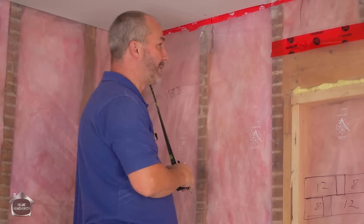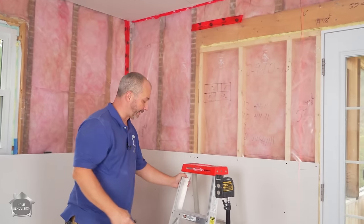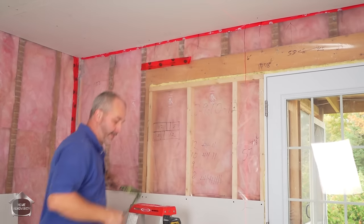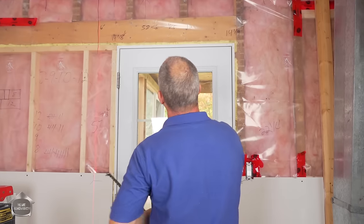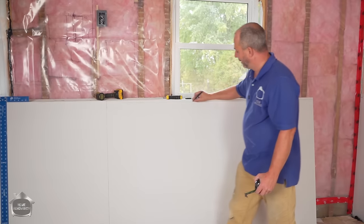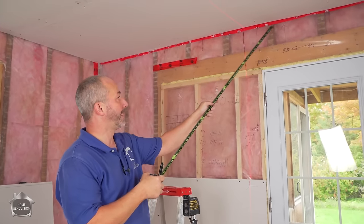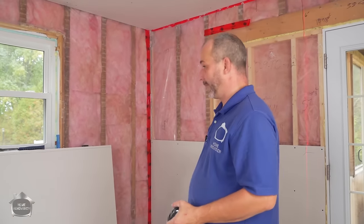This is just over four feet — don't need a measurement. That one's exactly four feet and I'm okay if there's a little gap at the top of the sheet — we can fix that later. Just under four feet over here, it's 47 and a half inches. The ceiling definitely drops here a little bit, so I'm taking a half inch off the top over here because this whole side drops. Now that I've got a level edge — you can see how the tape just pops down. So we're following this contour, cutting that drop in, and continuing to measure off this line at the bottom of the sheet to cut around the door and the plug. Once that's all done, we'll be ready to install.